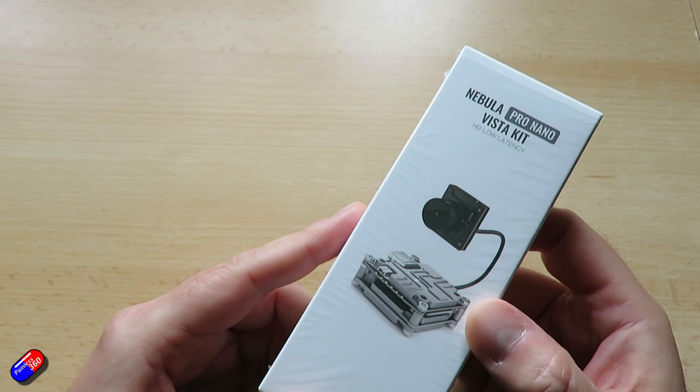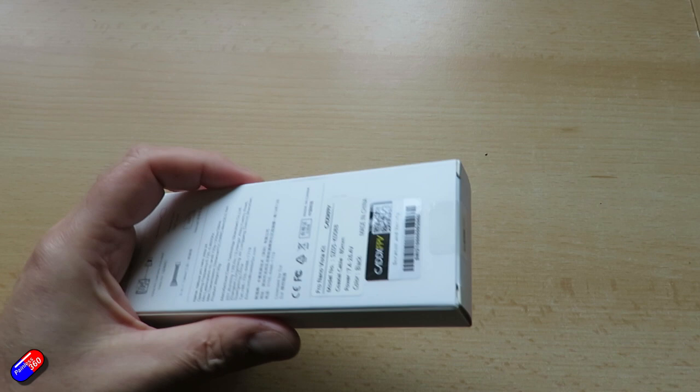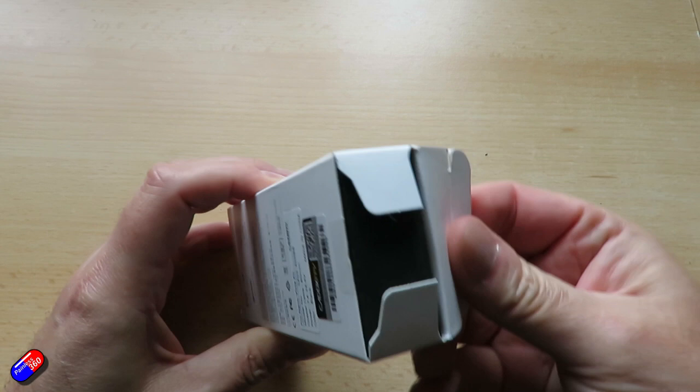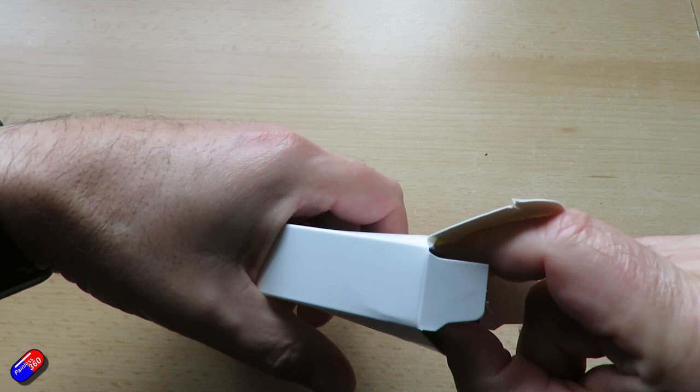Chip shortages since the start of COVID have meant that lots of other manufacturers have started to bring out cameras for the DJI system, which is great, but they are the larger size and typically use sensors that only allow 16:9 aspect ratio. For a quad I prefer 4:3 — I like 16:9 for planes. 4:3 seems to keep the bandwidth contained within the image I want, and it makes the OSD easier to see because I can stack them up the sides.